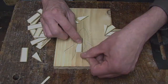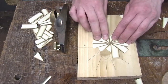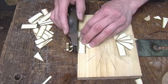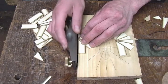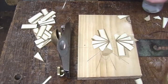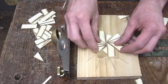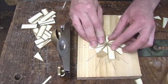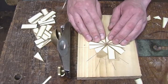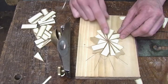Continuing on, keeping the shaded edge aligned and again starting with the shaded edge. Now I'm going to assemble the two halves to make the whole fan inlay — and that fit together without any work. Usually I have to do a little planing on one or the other, letting the edge hang off just a little and running a sharp block plane down it to refine the fit so they mate perfectly, but this one didn't need that. Another piece of veneer tape, making sure the segments are perfectly lined up. There will be a small oval of black in the center to hide any minor inaccuracies where the points come together, but I always like to have them as precise as possible. Now I'll put this under a board while it dries.